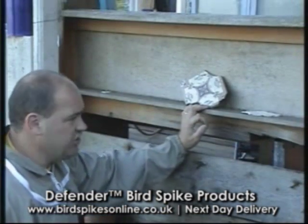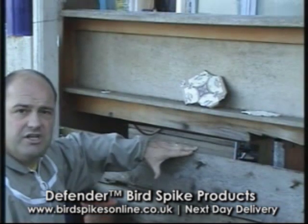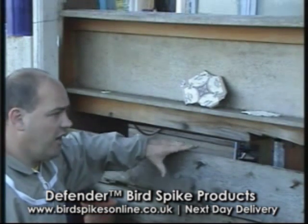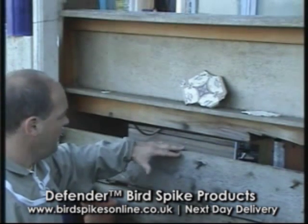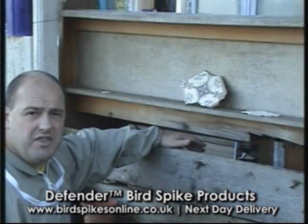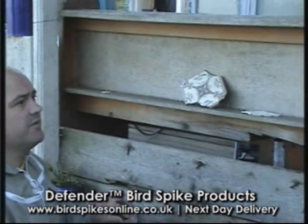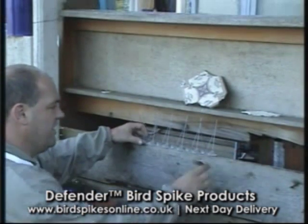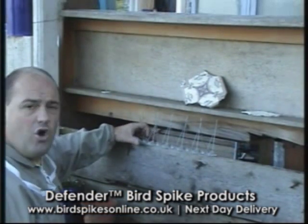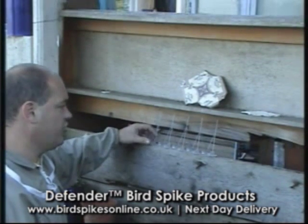Another issue I just want to touch on. Often why pigeons are on a ledge is because their nesting site is very close by. Here, the pigeons have been landing on this ledge and going into the cavity behind. That's where their nest was. The mistake an awful lot of people make is that they put a spike onto the ledge like that, thinking that the spike will block the pigeons from getting into their hole behind. Now that isn't always true.